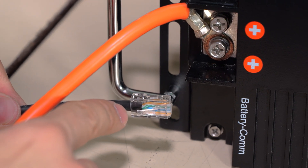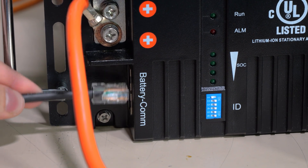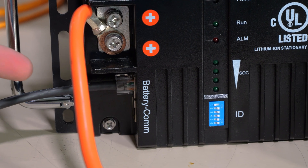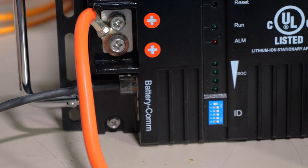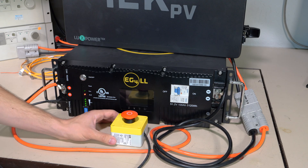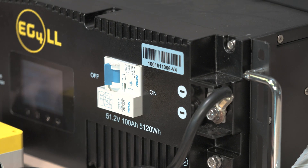With that connected to the green contact, put the lid on and screw it down. This cable can be quite a bit longer depending on where you need to mount your switch. This time instead of the CAN bus port, we're going into the battery COM port — it doesn't matter which port, as long as it's one of the available battery COM ports on your first or last battery, since the middle batteries will already have those ports in use. With this wired up, turn the battery on and once it boots up we're ready to test — hit the button and just a couple seconds later the breaker turns off.